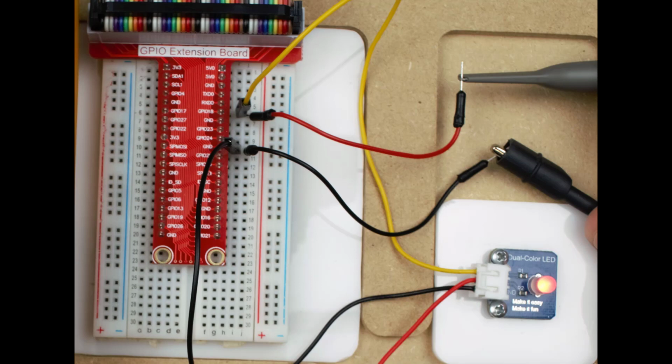We have one more final item that we need to do in order to read our digital signal. If we take a jumper wire that has 2 male terminals and we plug one of the male terminals into the breakout board at the GPIO 18 physical pin 12, and we take another jumper wire and connect it at physical pin 20 ground, then we will take the ground clip found on the oscilloscope probe and connect it to the ground jumper wire. And then the gray probe, we will open it up and hook the other jumper wire coming from the physical pin number 12.